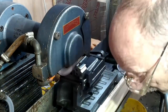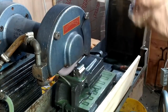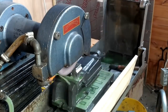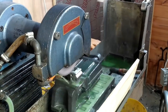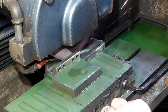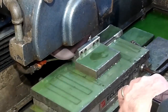Here I'm using a set square on the base of the vise up against the inside of the tool holder, then clamping it firmly. This should ensure that the ends are perpendicular to the sides and the top and bottom, but more importantly they will all be the same length. The bottom face of the tool slot is also to be dressed true to the top and bottom surfaces — it's needed to keep the tool square when clamped to the quick change tool post.